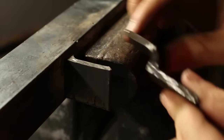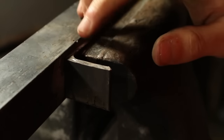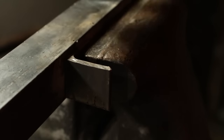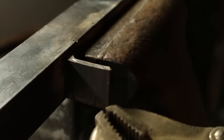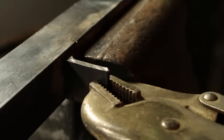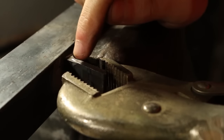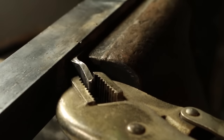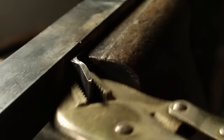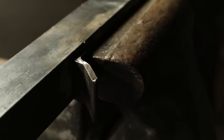And then just like I did in the Night Terror build, I'm gonna have to bend both of these brackets into shape. This is super simple — I just clamp the bracket in the vice with the rest of the angle iron to support the back of it so that when you're trying to bend it, it doesn't bend in the wrong spot. With it all clamped up, I use a pair of vice grips and I just slowly bend it backwards, trying to get as close to the bottom as I can to get a really sharp bend. Then eventually you can't bend it any further because the edge of the vice grip is bumping up against the angle iron, so from there I just use a hammer to go the rest of the way.